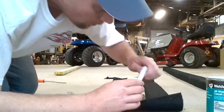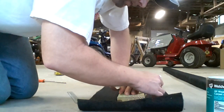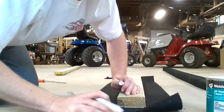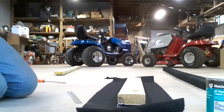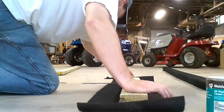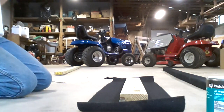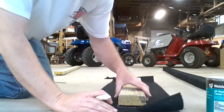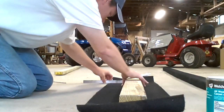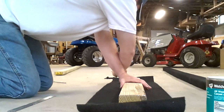So I figured out a white paint pen. You ain't got to get a whole lot of paint flowing, just mark it on the sides and lay it down where you can see it, and on the end there. Find your center down here - now with it four and a quarter. Oh yeah, that's great when you get a bowed board. I cut it off because it was bowed - kind of aggravating to work with, but it'll be alright. We'll make do. See if we can find our four and a quarter again. This is roughly close enough to four and a quarter on 12 inches wide, you're going to be close enough. Just mark it.